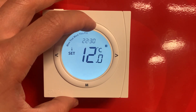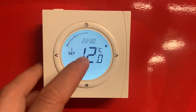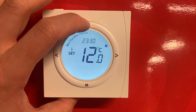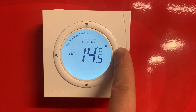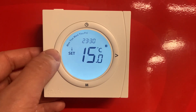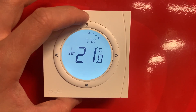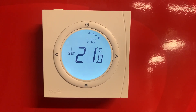This is when your second heating period will go off. Adjust the side arrows to set it for 11:30. Then set your setback temperature — this is the temperature your heating will revert to in between those heating periods. Adjust with the side arrows and press clock to confirm.